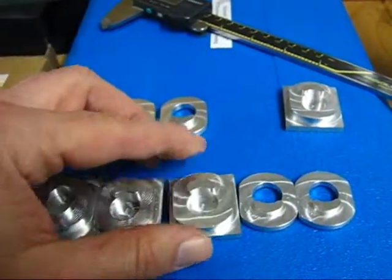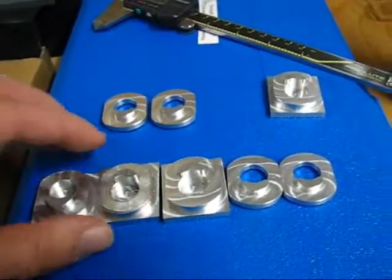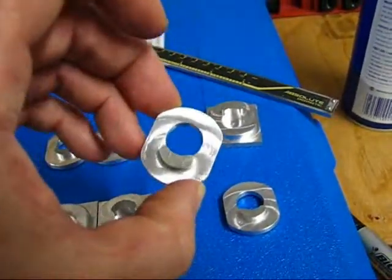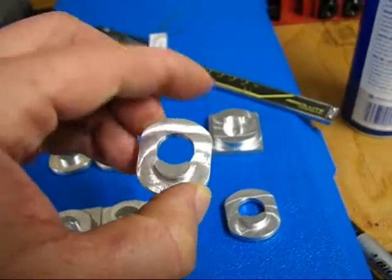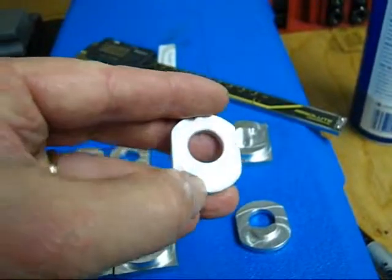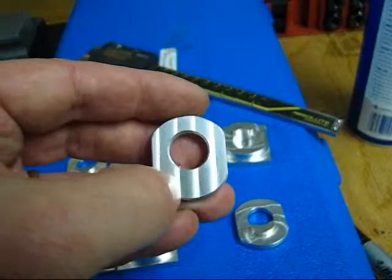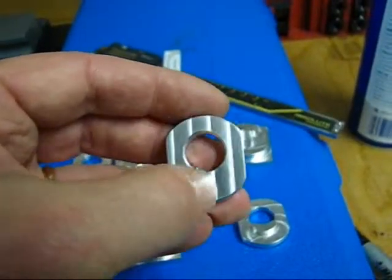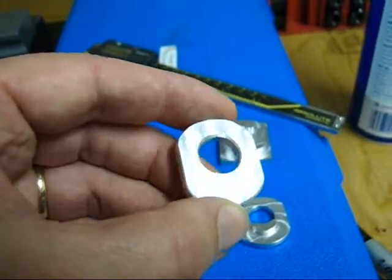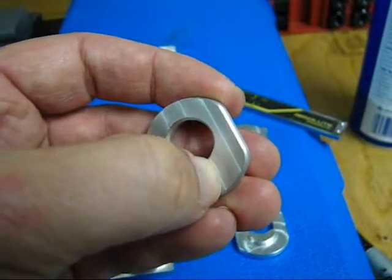Compared to this one, these were done earlier today. The hole in the middle wasn't quite the right diameter — they were also the first ones to test the run on the backside. So seven and a half inches per minute, 70% step-over — a little bit much on the loading on the end mill. There are some notable snags there.